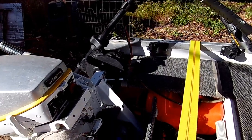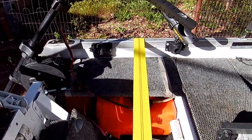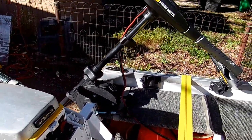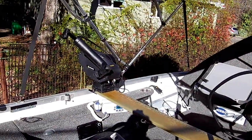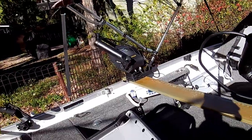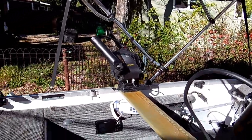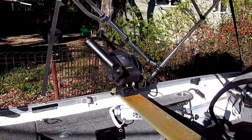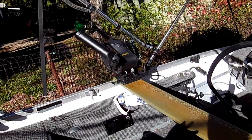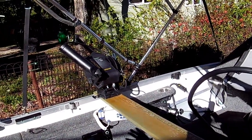Back in here I just have all my boat stuff and more storage. I built a lot of storage into the boat. There are two connections to hook to the trolling motor because I can run it off either the front battery or the rear battery. For the most part the rear battery is dedicated to it because it sucks the most juice. The rest of the boat runs off the front battery, except for the Hummingbird. The Hummingbird is on its own dedicated 10 amp hour lithium battery, which completely isolates it from other electronics and cleans up the screen — no interference. It just really loves being on its own dedicated battery.